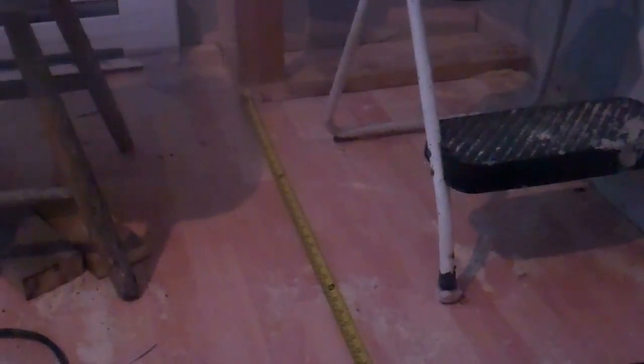I have 2 bifold doors, 36 inch doors, so the 2 of them are going to fit an opening of 72 inches. So you want to measure the opening you're going to cover, and in my scenario here I made it a little extra wide, 73 and probably about 1/4 inches, and I'll just adjust the doors as need be. I'd rather have it a little bit bigger and adjust the doors than obviously too small.